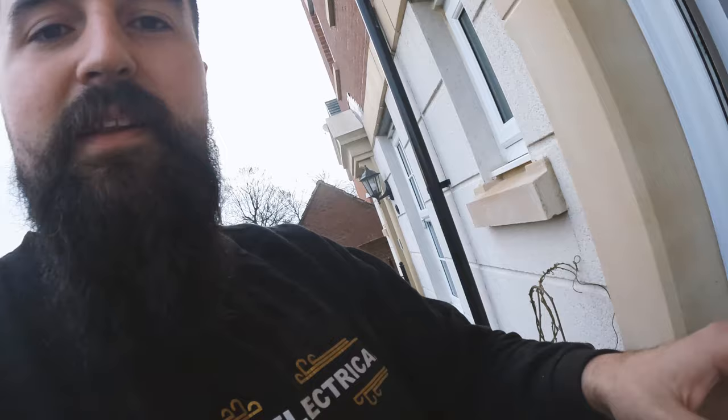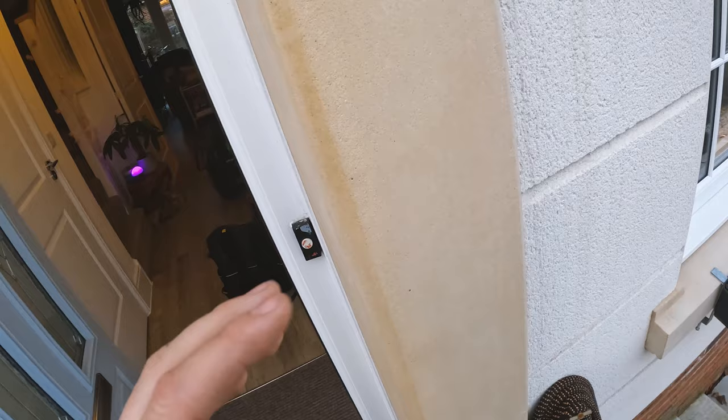So into the job then. We're going to install the Ring Doorbell Pro 2. We've done one next door - did a little TikTok on that one. Next door I've seen it and I think it's pretty cool. It's going to cover these cars, nice field of view. So we're going to mount it up here, drill through, get a cable from here to the switch, from the switch to here, and then hide the transformer in there. That's the job.